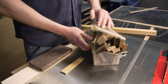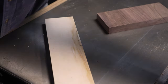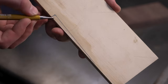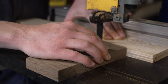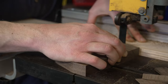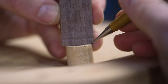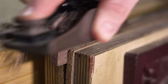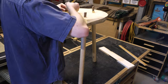I don't know if everyone else has a box of wedges like that, but I sort of use them to figure out my colour schemes. I've got that bit of walnut there which looks nice with the hoop pine. This little jig — you just have a cutout — is just for making wedges on the bandsaw. First time using it, it works well. The trick with these is just to make sure that the grain's running the length of the piece, not across, or it won't be strong enough. I just pop these in the vise and use a block plane to get them down to the right dimension. Cutting the slot — you can do that with a handsaw or just on the bandsaw.